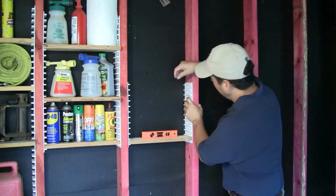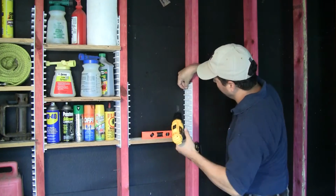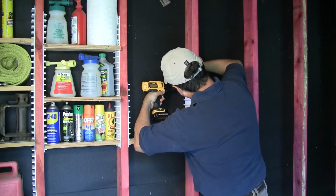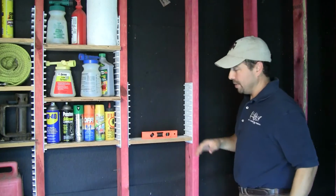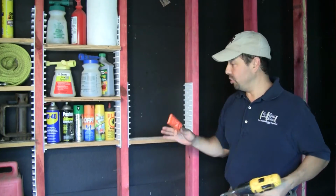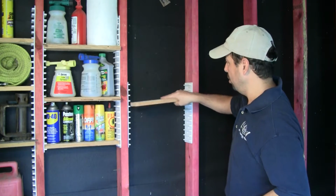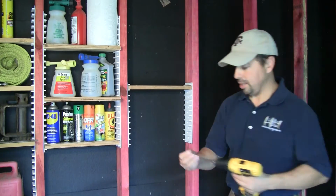I use my right hand and hold the screw. As I'm holding the shelf, I check my levelness. Center the screw in the hole. There we have it. You've installed your EZStudRack. You will no longer need this level unless you start a new row of EZStudRack. And I'll remove the shelf, move it to the upper level and continue on with the screws.